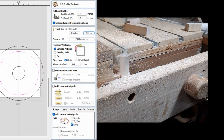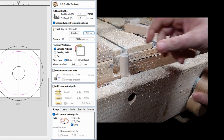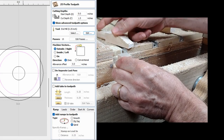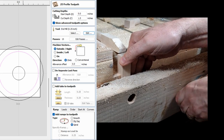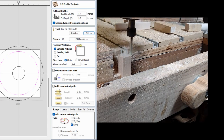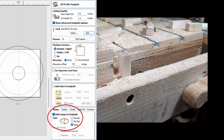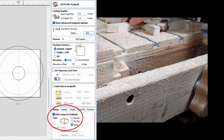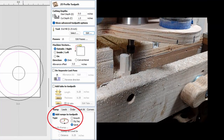I'm using a spiral toolpath to go down around these parts, and I use the spiral toolpath a lot. When doing a traditional toolpath your bit will drop down, do a complete rotation around the product, then drop down again, another circuit around, and you can get tool lines doing that plus it's starting and stopping. With a spiral toolpath it's continuous - it does not stop, so you're not getting those tooling lines, and it's faster. Setting up a spiral toolpath is not hard at all - it's a traditional profile toolpath and the only changes you have to make are at the bottom where I put that red circle. Almost every profile toolpath I do is a spiral toolpath.